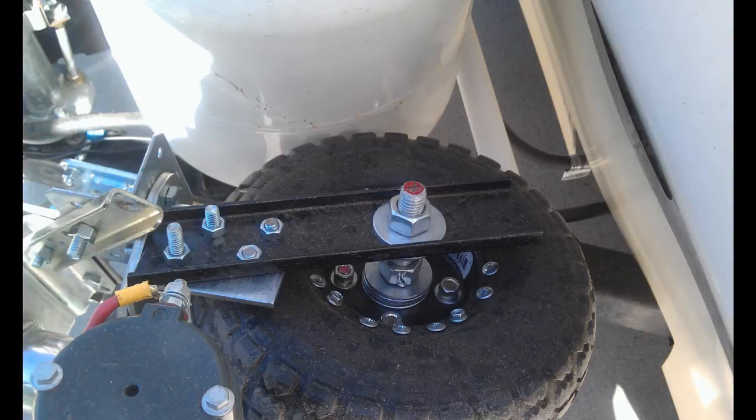The tires I ended up with are not the ones I began with. The first tires and wheels I bought had an inner tube, and the traction on hard concrete was so great that climbing a little hill in my driveway, it spun both tires on both rims and sheared off the valve stems. So I bought the same size tires and wheels except with solid rubber tires, and as you can see in this picture, I screwed them on and it works great.